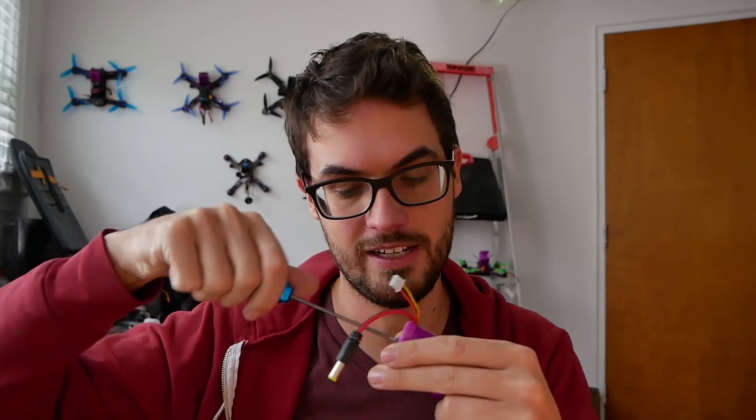The other thing I wanted was to make it assemble with screws so it was easily disassembleable, which is why I'm doing this video today — I need to disassemble it because one of the wires for the balance lead seems to have come disconnected. The balance battery checker doesn't light up but I know the battery is good, so I'm just undoing these screws.